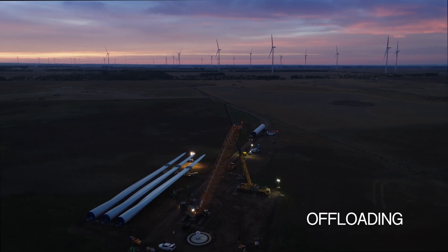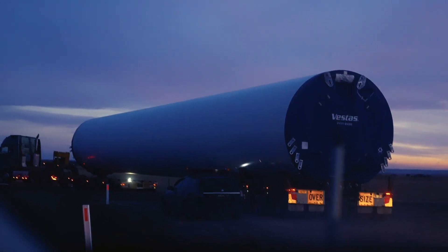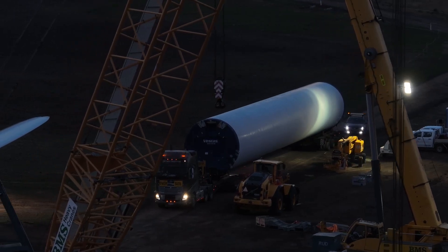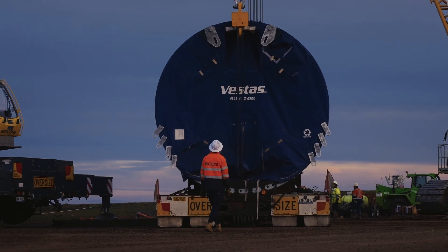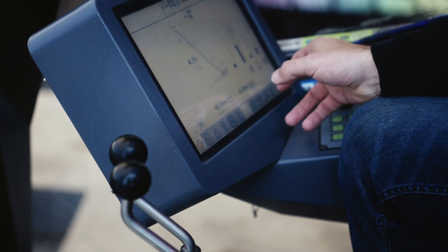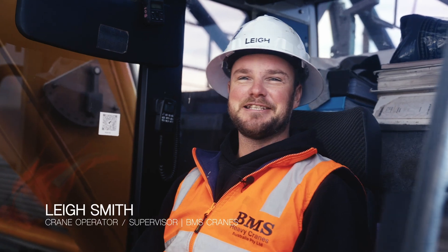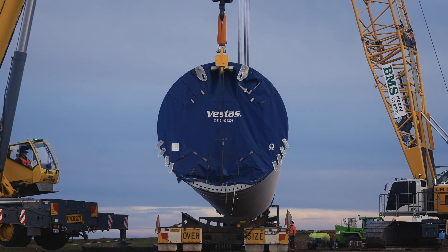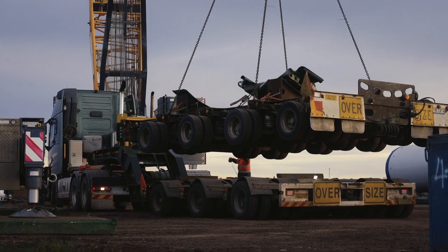A tower section is typically between 30 to 50 metres long. A blade is about 80 metres. We've got a truck coming in now delivering the T6 tower section, also known as the top tower section. It will be guided all the way to the hard stand — we've got two cranes there. It will be dual lifted, one on either end, offloaded to the designated location on the pad. We do all of our safety checks, and the first lift this morning was a T6, which is a total load of about 88 tonnes.